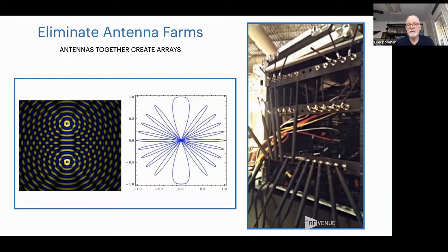If you stack them all over the place, you get unpredictable results everywhere. Ultimately what you end up with on your stage is hot spots and cold spots. If you look at that horrible design on the right, that's based on just two antennas very close together. When you have 20 antennas, who knows what you're going to get — and that's the problem. There's no way to know. So that's another reason to avoid antenna farms.